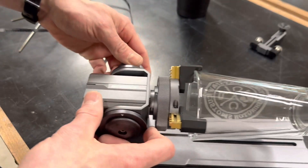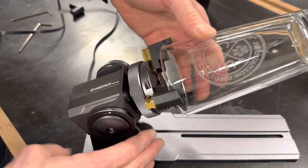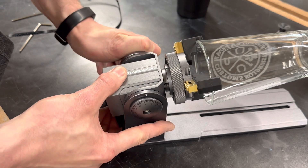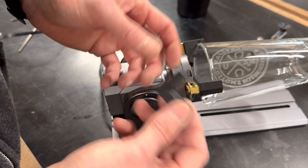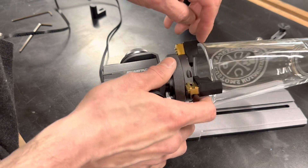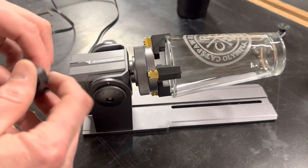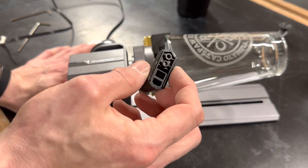For the R1 chuck, I like it about 90%. My two complaints: first, you've got to be careful to really get it tight or it'll sag a bit — it's fine with lighter things, but with heavier stuff like glass you have to be really careful to keep it nice and tight. Second, the jaws give a huge variety of ways to hold the object, but as I showed earlier, you've got to be careful that the laser doesn't bump into your chuck jaws, which can limit how big a graphic you can put on whatever you're engraving.